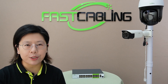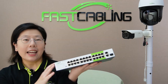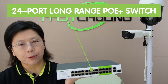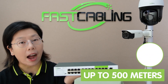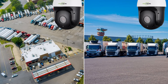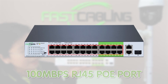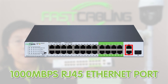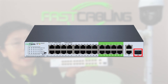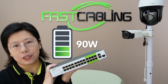That's why I'm going to introduce you to the alternative long range solution, which is using a long range PoE switch. This 24-port long range PoE switch is a powerful network device that effectively extends your PoE range up to 500 meters, allowing IP cameras to be deployed flexibly anywhere in the truck parking lot. It has 24 100 Mbps RJ45 PoE ports, two 1000 Mbps RJ45 Ethernet ports, one gigabit SFP port for high speed data networking, and a power budget of 225 watts.